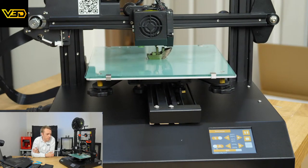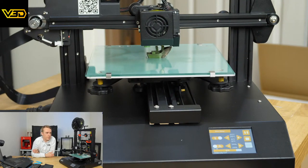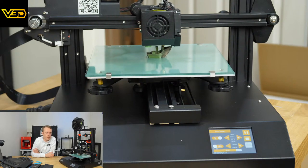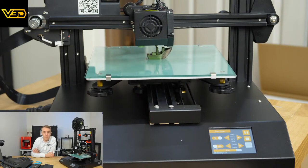Polycarbonate. It's one of the recommendations when printing a PC blend, which is a polycarbonate based material with presumably some additives to make it a little bit easier to print, from Prusament. And they recommend using glue stick as a release agent when printing that material, because otherwise it sticks too much to the print bed.